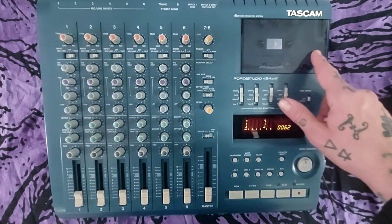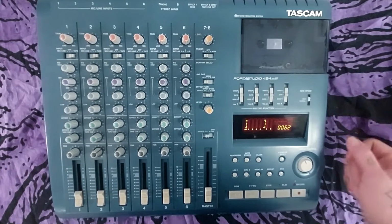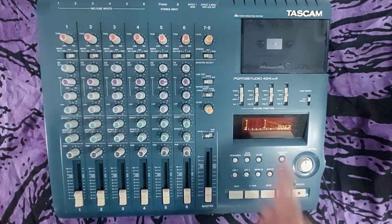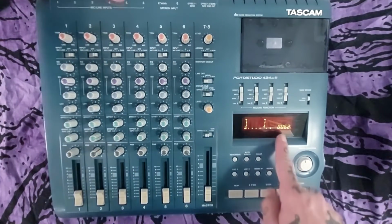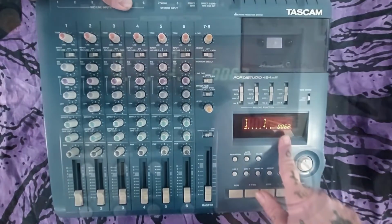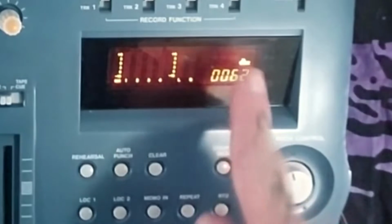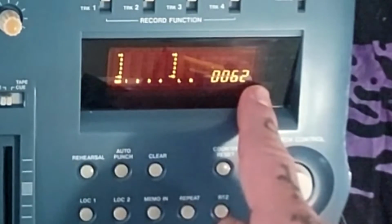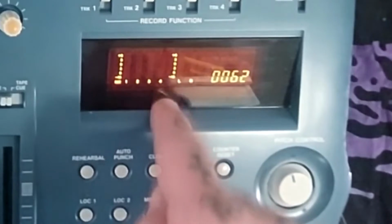We can process the sound using DBX noise reduction. The switch to turn that on and off is in the back. It's currently off. Hopefully using the magic of post-production, I can zoom in on this bit and you'll see the DBX light come on. You can turn that on for all 4 tape tracks, or just 3 of them and leave it off in track 4.